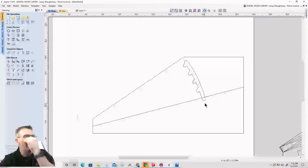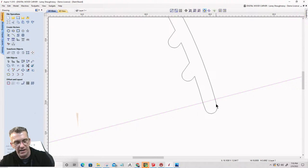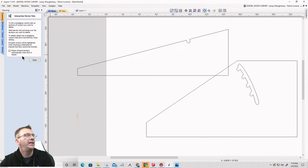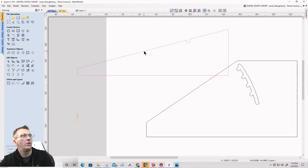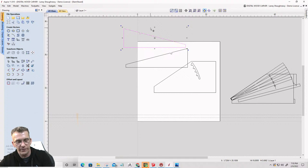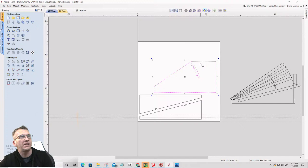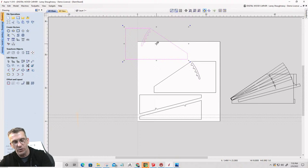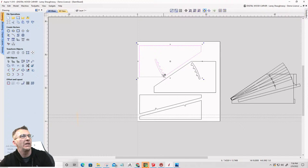So let's extend it down. I'm going to go with a 0.375 circle and give it some room. I'll go tangent to tangent — T for tangent, spacebar, click on the other side, T for tangent, spacebar. And then I can trim that away. I've just extended that slot slightly so the rod will be able to sit down there below when at its rest state. What that means is this notch right here needs to also be carved out of the two side pieces. Control C, control V to copy and paste, take my scissors and trim away this notch. Control key to make a copy, hit H for horizontal, V for vertical, get that into position for nesting. That takes care of the slant board — all the parts I need. Finally, that took a whole 45 minutes to fix and lay out.